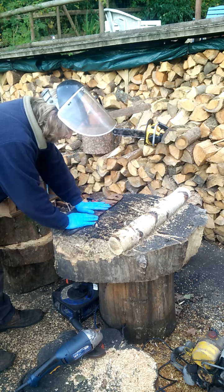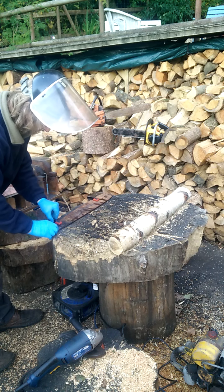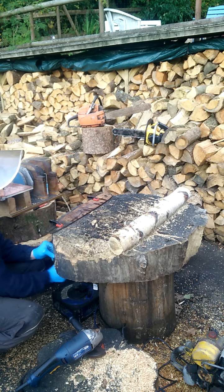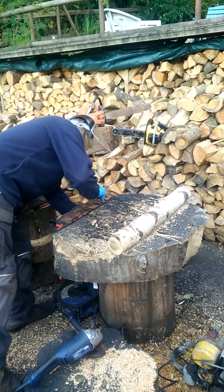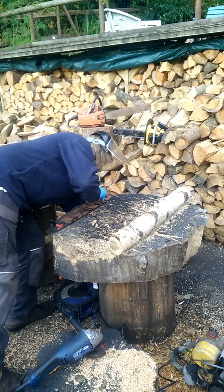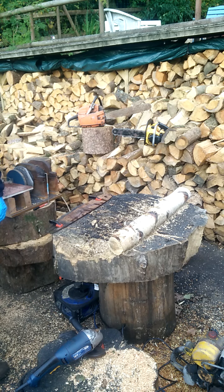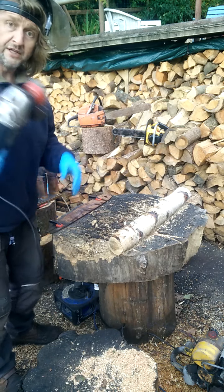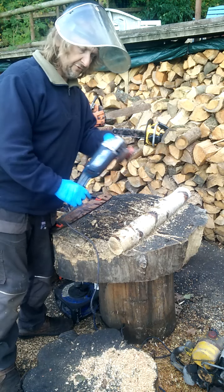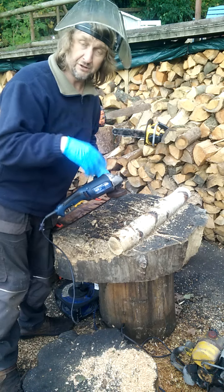I found it works really, really well to get the bars onto a very stable surface - I love working on some of the old discs I have. Then I'm going to clamp the guide bar so it doesn't move while I'm finishing or taking the surface off it. These twisted knot grinders really are very, very aggressive but very effective. Always, if you're using this, you have to have two layers on because these things come off like nails - and also really substantial face protection.